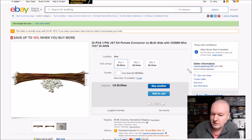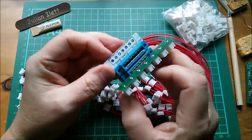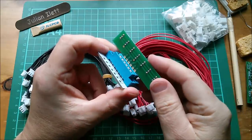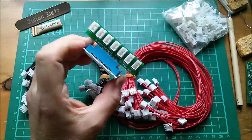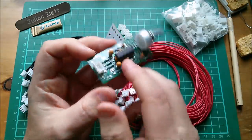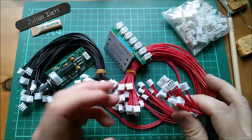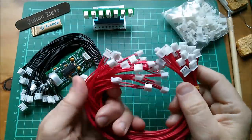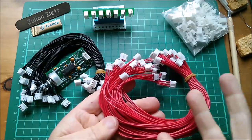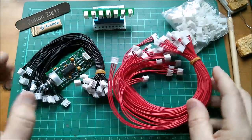Is this good or bad that they've substituted these multicolor cables for cables which are one color? I don't really know. The way these work is that I've got power going in onto this board on these little terminal blocks. That then comes up through this edge connector type socket and gives me a distribution on three-pin JSTs. Then I will link the three-pin JSTs on my power distribution to the individual boards. I could have made these up myself by buying the crimp tool — they're about $15 — but I just thought I don't really want to get involved in all that; I'd rather have them pre-made. So these are fine. It's just this issue of whether I particularly wanted my color coding scheme of black for zero volts, red for plus 12 and yellow for minus 12. I won't now have that with these cables.